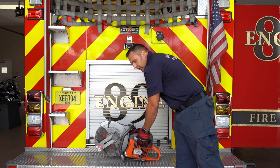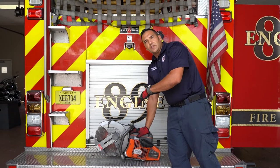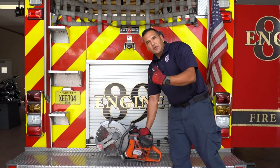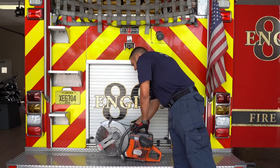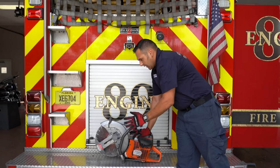When you pull this cord, you're going to pull it until you hear the motor try to turn over. You're not going to start it with the choke out. When you hear it doing that turnover, that means you don't need the choke anymore, so you're going to take this blue lever and push it in — now there's no longer any choke. Make sure that decompression button is still pulled and you're going to fire it up again. And now it's good.